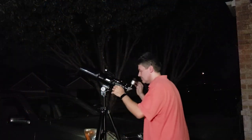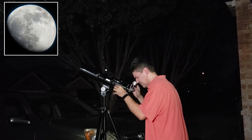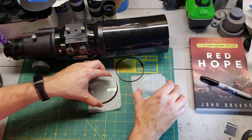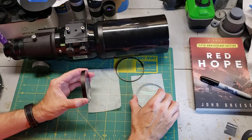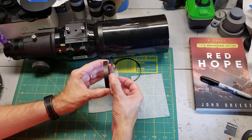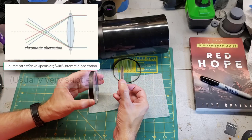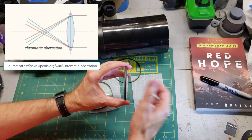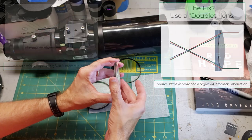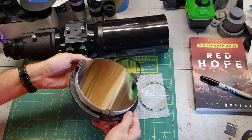I took a lot of time to clean it up and make it look good as new, and I even used it a few times. The moon was super sharp, but it did have a slight blue fringe around the edge. These type of refractors have two lenses at the front, stacked like cookies and kept with proper spacing with rings. The idea is that these specially designed lenses eliminate chromatic aberration — something that's plagued refractors for hundreds of years, where light going through a lens breaks up into its constituent colors and they don't quite focus properly on the other side. This is very bad for telescopes, and it's one of the driving forces behind why Isaac Newton designed his telescope with mirrors.